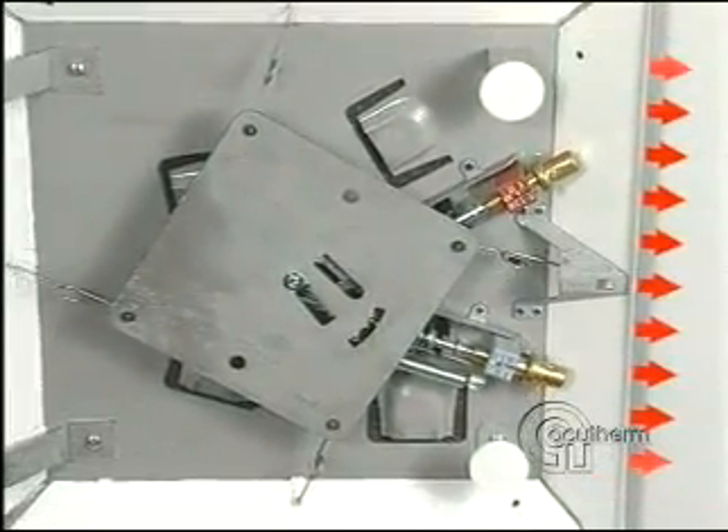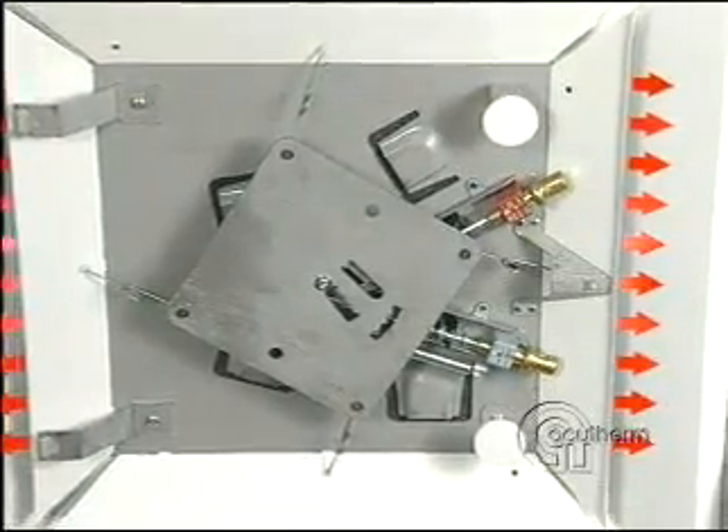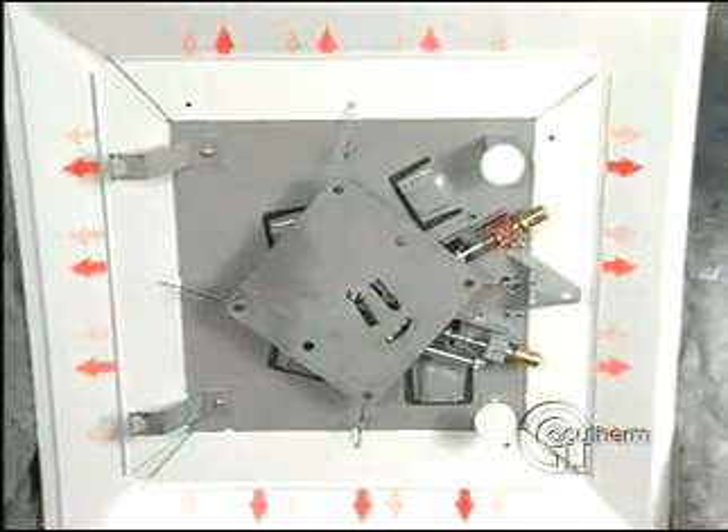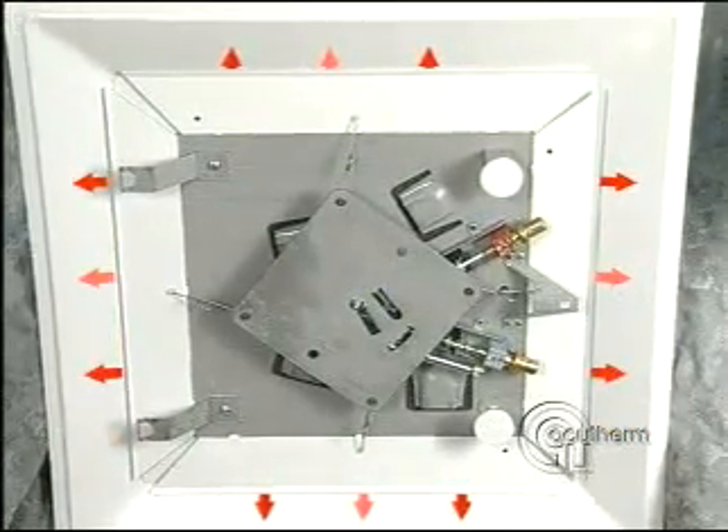Because the central plate is over center in heating, the action is reversed. Now, when there is a warm room, the blades close. In a cold room, the blades open.